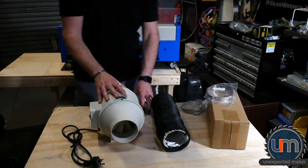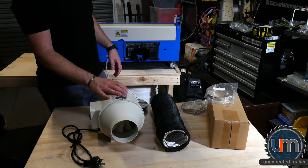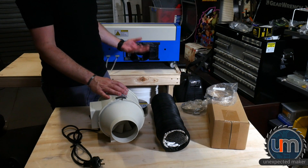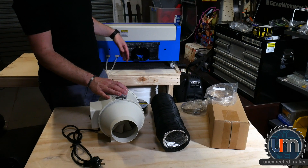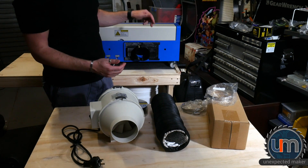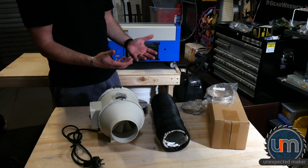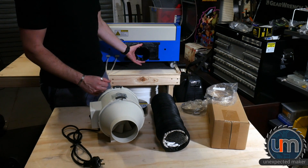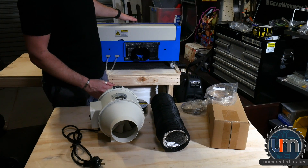One of the things you really need to be careful of with any laser cutter is that sometimes it's just extracting smoke, which is fine, or debris from the cut. But depending on what you're cutting, it could actually be extracting toxic fumes. A lot of plywood or other materials you might cut is glued together, and you don't know what type of glue was used. So you get a laser heating up and cutting glue that could give off any type of toxic fumes. It's very important to have a sealed and reliable extraction system to make sure there's no residue inside the unit, especially when you open it up.